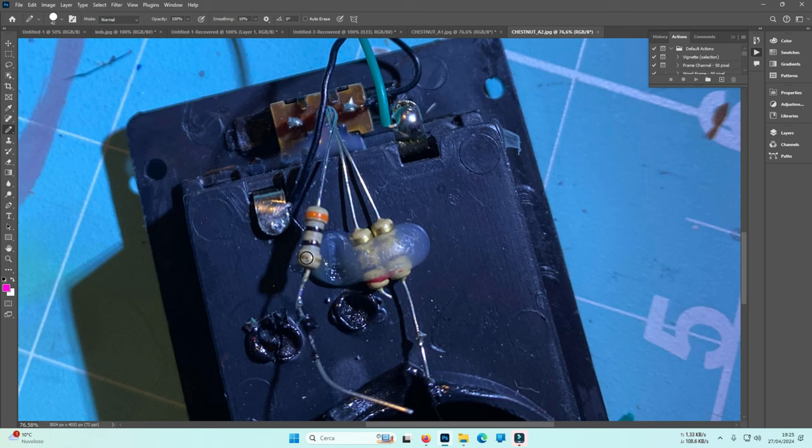That is an elevated value for this resistor. Those ones are red, black, gold. So red, black, gold. And red, black, gold is 2 ohms, ridiculous. So I suppose one or many of the LEDs are whitish or bluish. Okay.